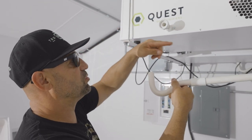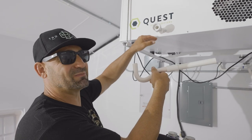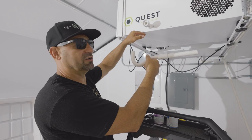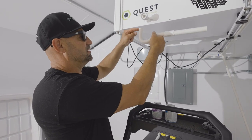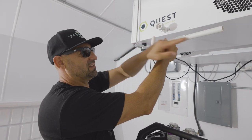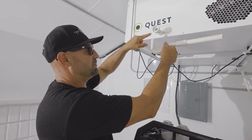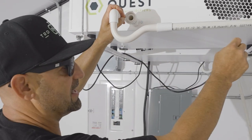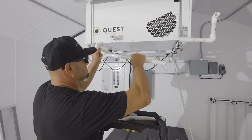Now when this unit is actually on, it's creating negative pressure which is actually pulling air through this vent because the airflow goes through the coil. What ends up happening is water ends up sitting inside your dehumidifier or your air conditioner. This little amount of water actually stops that negative airflow through the pipe.